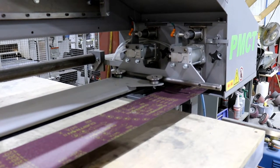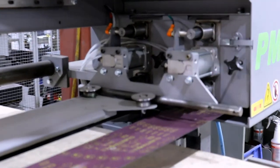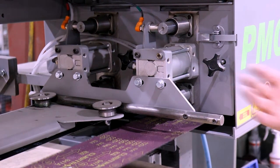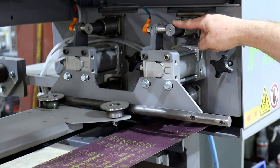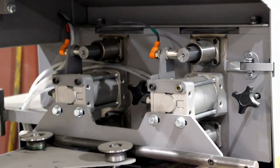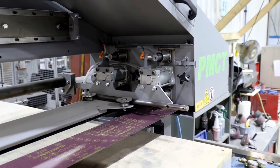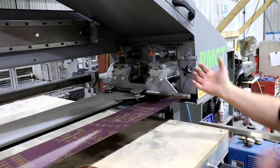The PMCT-HD is equipped with a pneumatic belt tensioner that allows removing or applying tension on the belt when we have to change the belt. It also has a breaking belt detector that stops the motor when the belt stretches too much or breaks. Each pneumatic belt tensioner is activated individually.